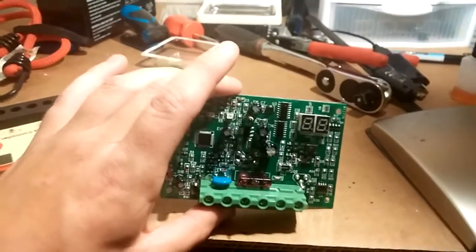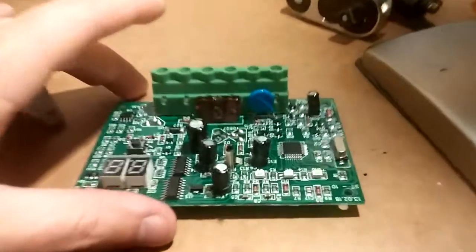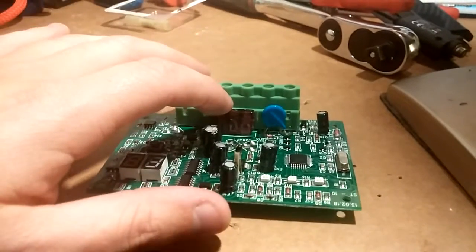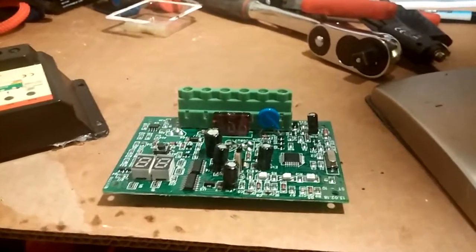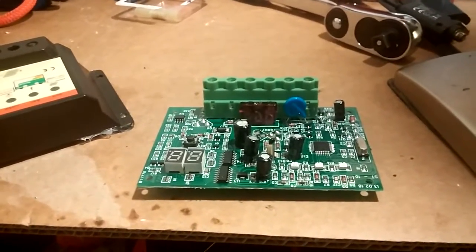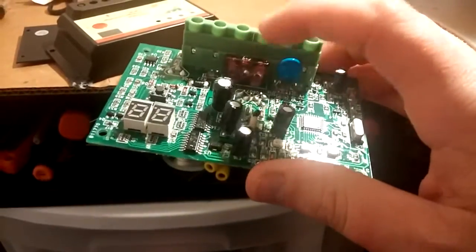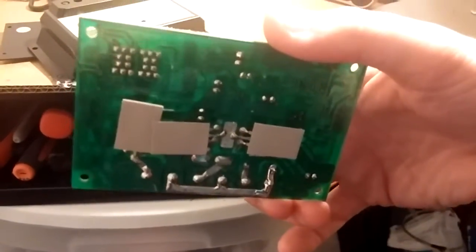Why would they put a 40 amp? Why don't they just put a 20 amp slow blow in there — a fuse that could take a few seconds of more than 20 amps before it blows? I guess I'll just replace it with another 40 amp. I'm really thankful for this because it would have screwed up my batteries and solar panels. I only paid like 12 bucks for it, but you gotta wait so long for delivery from Amazon, so I'm just gonna replace this fuse and hopefully I'll be back with my 20 amp so I can run both of them.